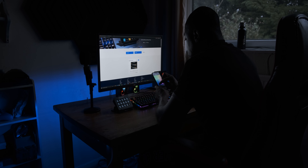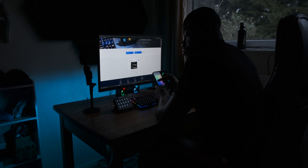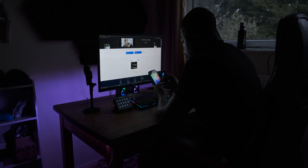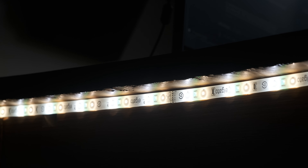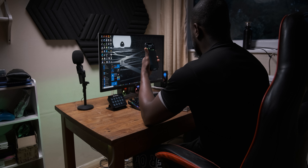Once paired, because the light strips are Wi-Fi based, you can control them with the Elgato Control Center software from either desktop or smartphone, and it interlinks between both, which is really convenient. As for the light strips themselves — I actually think they're really good. The brightness levels are good, the colour options are great, and the strips give a good quality hue. I have no complaints, and the anti-flicker claim seems very true: all the shots I took at 60 frames per second on my camera showed no sign of flicker at all. Big well done to Elgato there.